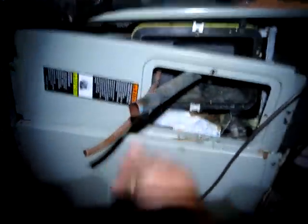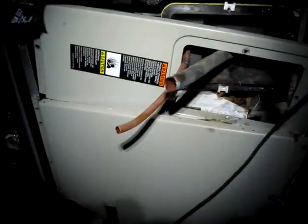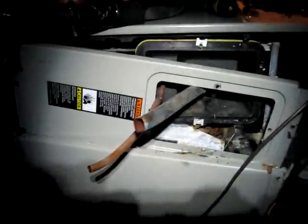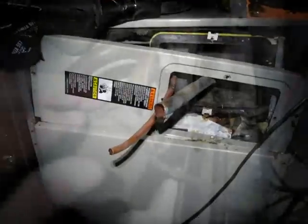Our first step after we let out all the nitrogen, we come up here and disconnect the coil. See the Trane air handler — it's our blower, heater. There's a transformer because we have a zone system. Transformers power the dampers, especially if they're spring dampers. They eat up a lot of electricity and they need an extra transformer for sure. The newer power open-closed dampers don't use as much electricity — I think it's about a quarter of what these spring dampers use. Now we can pull the coil out, sweat out the TXV and put the new one in.